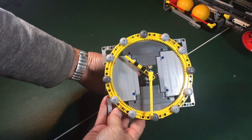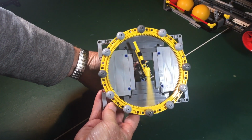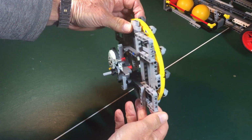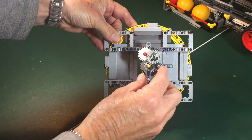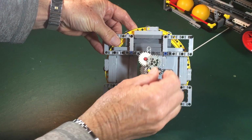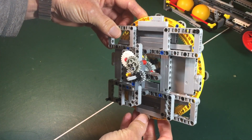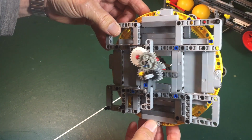The problem to solve is to take the minute hand that goes up the centre shaft and to divide the rotation by 12 for the hours before putting that rotation back onto the same axis as the minute hand. In my design, I used the older style Lego differential housing for the hour hand rotation. It allows a Lego axle to pass straight through it for the minute hand, but also has the gear so that it can be independently rotated around that shaft.